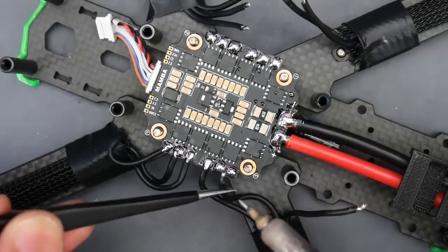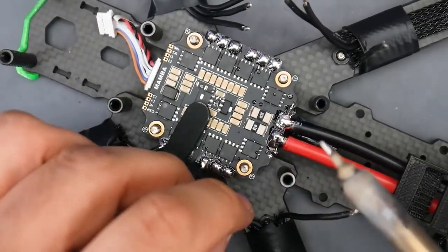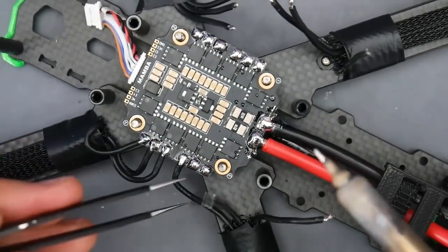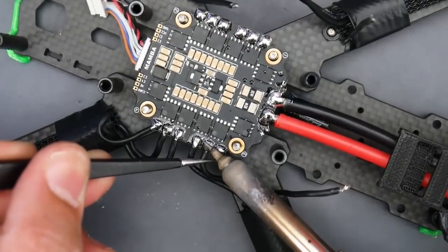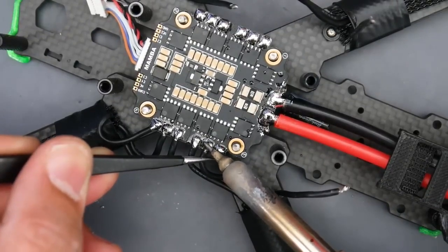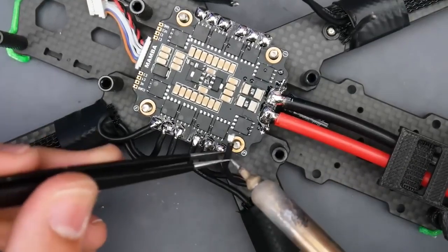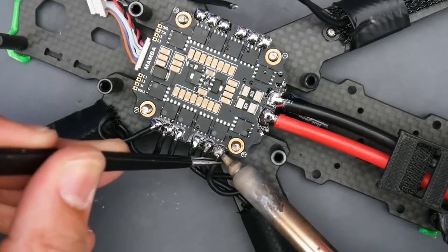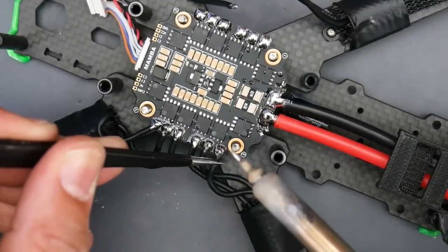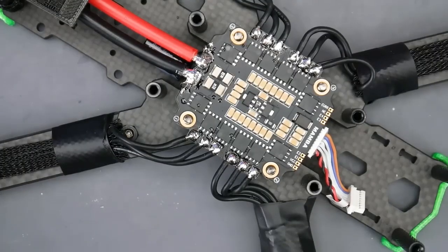And again, I twisted the wires and also added solder on them before I started this step here. So I'm just going to bend this like that, just to make my life a little bit easier. And you should always keep your tip nice and shiny, not like mine. But we're just going to go ahead and execute this. And now the last one. There we go. And beautiful. So we have one side done, and basically like that, guys, we're kind of done.